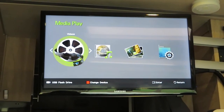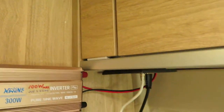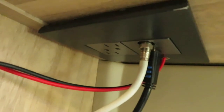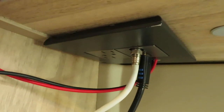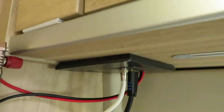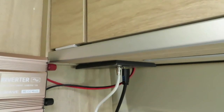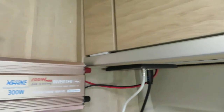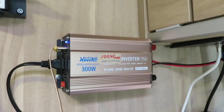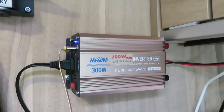This video is about watching TV. My television used to be powered by the house inverter through an AC outlet, and the house inverter alone has a 60-watt overhead. So every time I watch TV, even though the TV draws 36 watts, I have to turn the inverter on which is 60 watts. So I installed an inverter with an overhead of only 3 watts, used exclusively for the television.